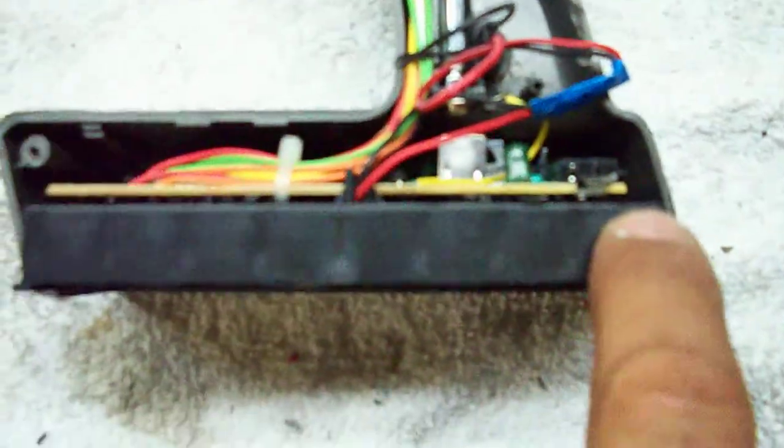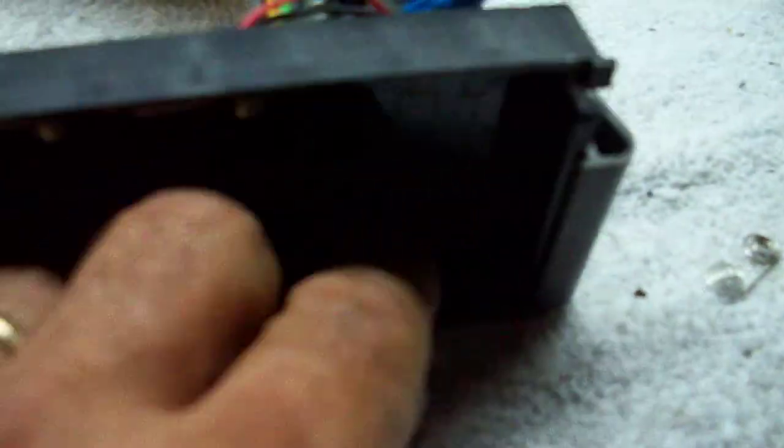What you're going to notice is this black and red wire — one connecting over here, which would be the black, and the red over to this side. You're going to want to disconnect them from these little prongs. These little prongs pretty much just slide right out — take every one of them out. The ones on the ends are going to be stationary because they're soldered in. Heat up your solder iron, just loosen up the solder, and it'll pull right out.